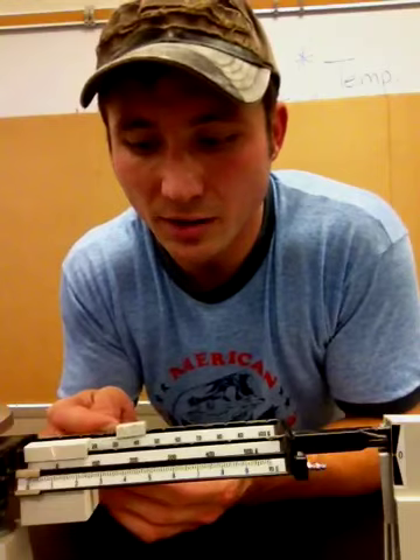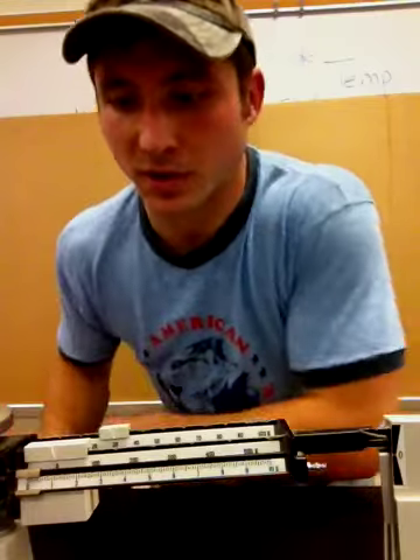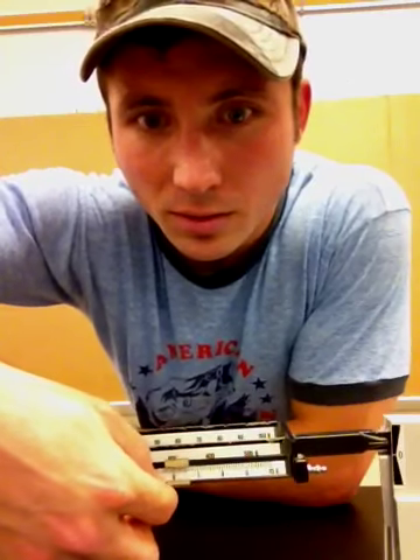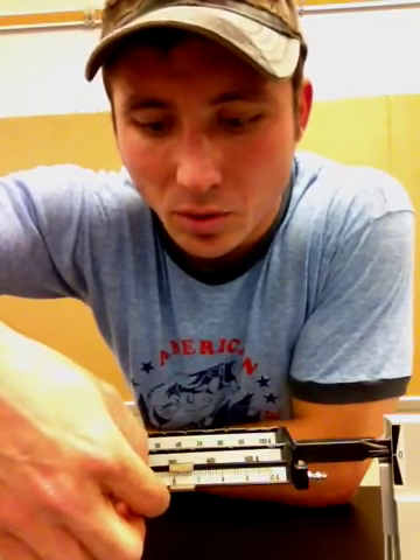It's still not down, so I'm gonna have to add a little bit more — moving it up to 30 grams. Still did not drop the pin over here, so I'm gonna add a little more. Now it dropped — that's right, go back one more space with that particular measuring device. Now I'm gonna start adding with the very small one, slowly adding and watching for that pin to drop. It's starting to drop now but it's still above the zero, so I keep adding. Now we're almost exactly at the zero right now.